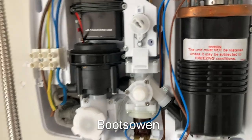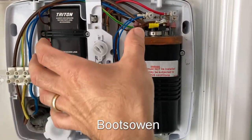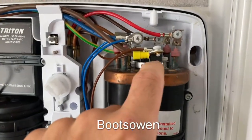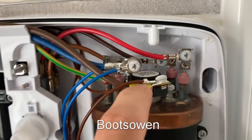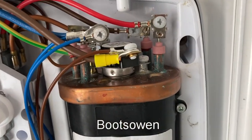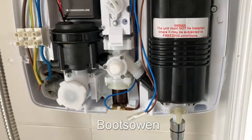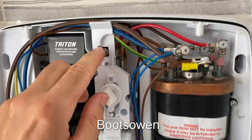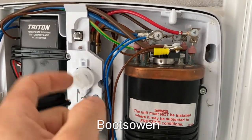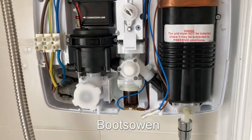Nothing left for me but to put the cover back on. I fitted this and it was quite easy to fit. I had to move the shower head over because previously it was a vertical one — it was an old Red Ring that was here before, and I made a video of that after I took it out. It was a torture because this overheating thermal switch used to cut out all the time. So you had to take it off, but it didn't have screws — it had a little hex head, need to get needle-nose pliers, take it off, reset it. Whatever way it worked, I think it was this switch on the knob, so when you turned it on if you didn't clunk it off properly it wouldn't touch the microswitch at the end, so the motor would stop, the pressure would fall, but the boiler would keep boiling. Anyway, that's in an old Red Ring video — if I can post a link to it here, I will.